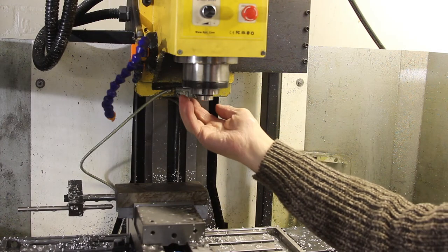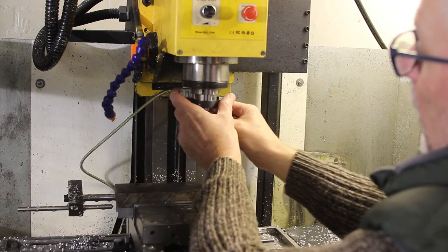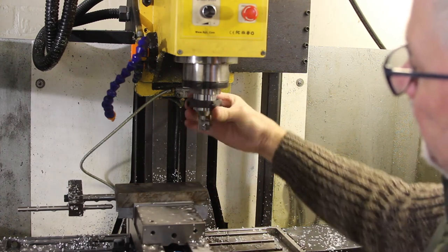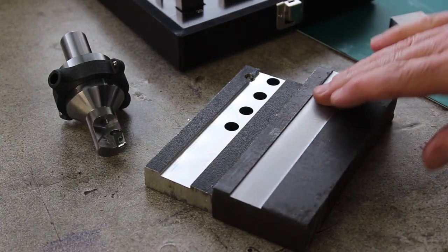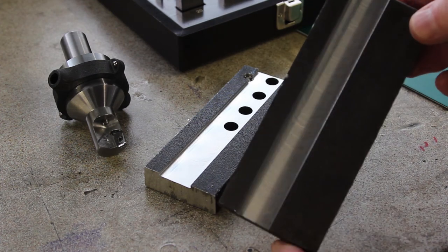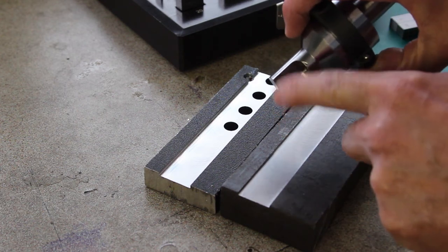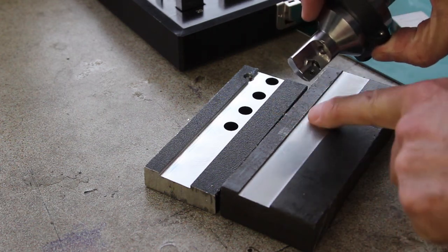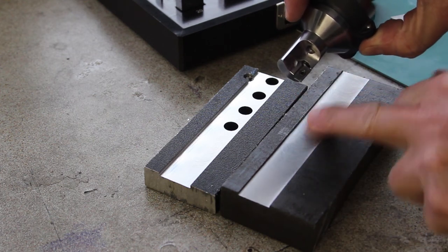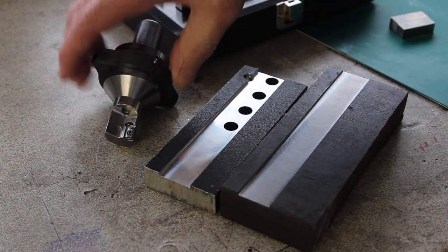I thought it might be interesting to see what this cutter works like in scrap steel. Right, so there we are. Finish, yeah, it's all right. It's pretty good. Considering it's actually an aluminium cutter, not designed for steel, I'm not sure that the steel ones seem to be blunter to me, so I'm not entirely sure that it would make a good job, because I don't think that my mill is rigid enough.